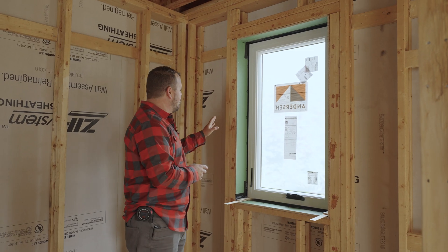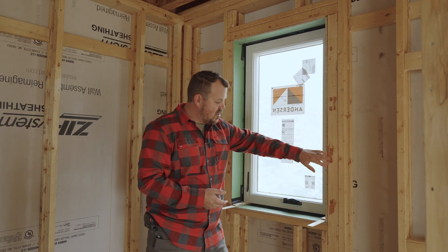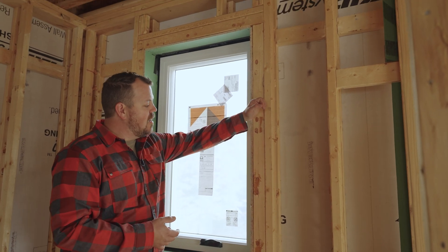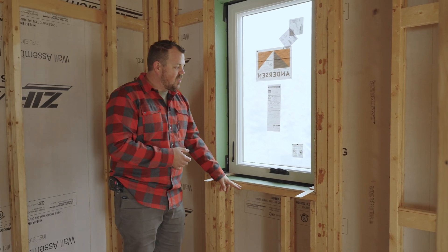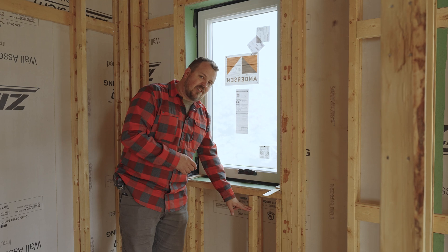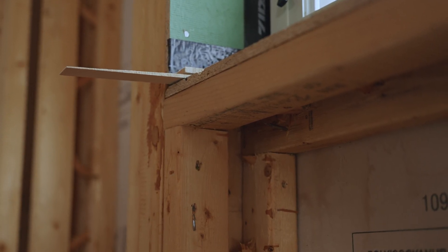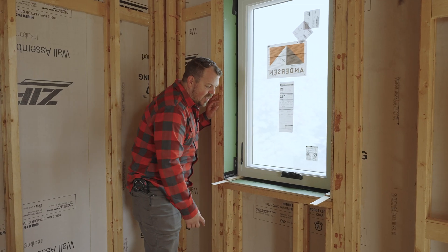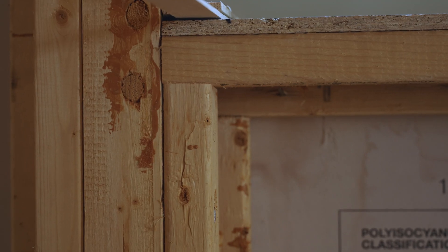We have a mated pair — a king and a jack that are offset in orientation, or really two kings. We have a king, then a jack, and the studs underneath are T-studs as well, and our sill is a T-stud. That offset means pieces are cut at two separate heights — one is an inch longer — so you have to orient everything with the wide side of the T-stud on the wide side, or flange on flange. There are a lot of bearing questions to address here.